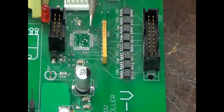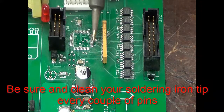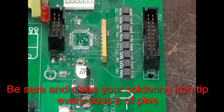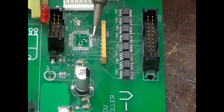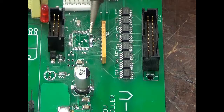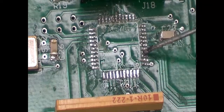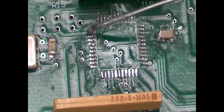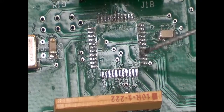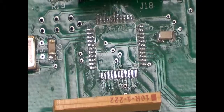What we're left with now are all of the leads still attached to the surface mount pads on the circuit board. I come along with my soldering iron and clean up each lead one at a time. As you go through here, you can preserve these very delicate surface mount pads and pull off all of the leads. I'll do one side here, clean it up — you can see the pads are clean on this side, while the other side still has all the pins. Go all the way around, remove all these pins with your soldering iron, cleaning up the pads as you go. Since you're only removing one pin at a time, it's very easy to clean up the board without damaging it.